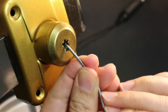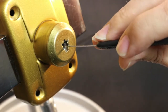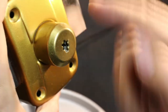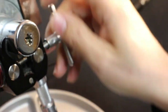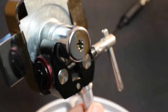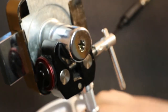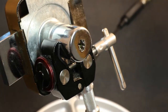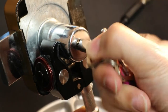Why didn't I have to pick it 12 times? This is the interior side of the lock — the interior side only has the top three pins. Now we'll go on to the real meat: the exterior side, which is fully populated with all the stuff. To save on production costs, the interior only has three top pins to keep it from moving freely — you're inside the house and don't need protection from going out.